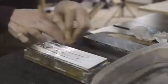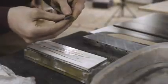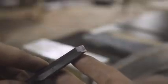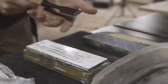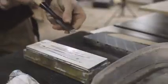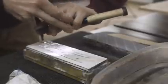So the first thing that I want to do is I want to see just how out of flat the bevel is, and in my case it wasn't too far out. But if it is, you want to go to the bench grinder and you want to grind it out. And I want to do a separate video on this because I feel like this is super important and it can save you a whole bunch of time. But as you can see, I'm high in the middle and low on the outside corners, which is not awful, but I do need to do a little bit more work to get that dead flat. And it was probably only like 2 or 3 extra minutes to get that dead flat from where I am.